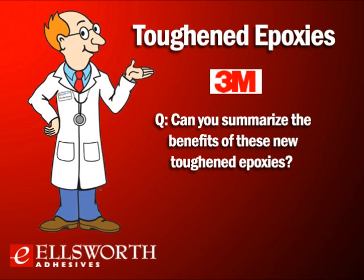To summarize the benefits: the 405 combines toughened properties with a 5-minute work life and 10- to 15-minute handling strength, creating a fast, impact-resistant, high-performance adhesive. The 405 LH adds the value of meeting the IEC standard for low halogen content — less than 1,500 parts per million. The 420 LH carries the performance and proven reliability of DP-420, also meeting the IEC low halogen standard. The 920 is a toughened epoxy for oily metal surfaces with advantages over acrylics in overall strength, environmental resistance, solvent resistance, shelf life, and odor.